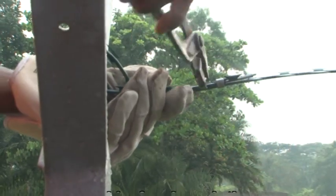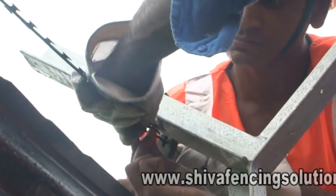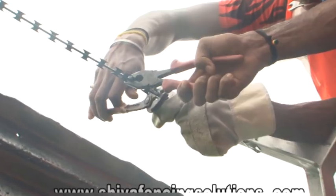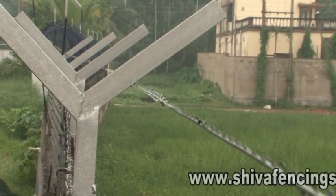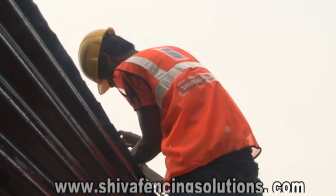At the initiation post, the razor wire line should be wound around the fence post, twisted, and finally clipped with U-clips. The other end should be similarly fixed under taut condition, and thereafter the line is fixed at all intermediate fence posts by a box-clip nut-bolt arrangement.